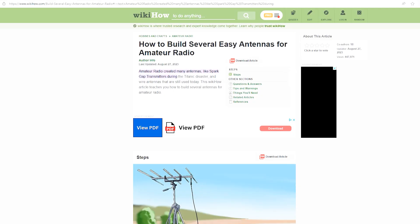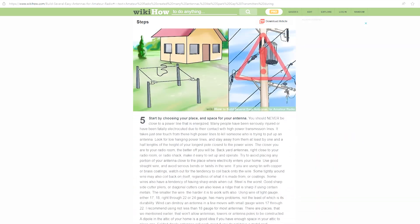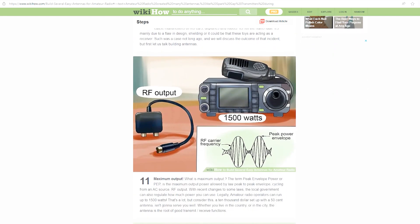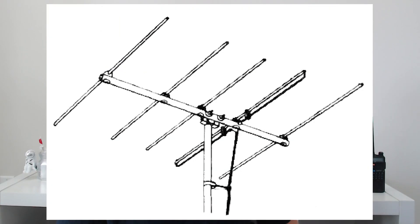One of the things you can use your Baofeng for is learning about antennas. Although I've purchased the main antennas I use, you can save tons of money and create your own antennas with things you probably already have laying around your house. A simple wire or even copper pipes can be cut to certain lengths and shapes to design your own antennas for different uses. Take the J-pole antenna, for example — it's just a few copper fittings and pipes, easily made at home for just a few dollars' worth of copper. You can even make antennas designed specifically for satellites, and hook them up to your Baofeng using a cheap cable off the internet.